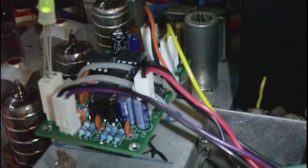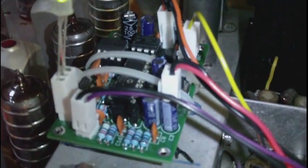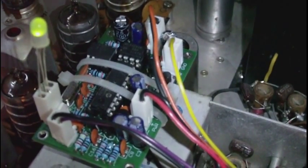I would call this a success. This little circuit cost about 40 bucks and took a couple of hours to build. I'd put it at medium difficulty level — you just have to use a small low-wattage iron since the traces are really small, and some of the parts like the quarter-watt resistors are small too. You just have to be careful to get good soldering and use a magnifying glass. It worked right off the bat — I didn't have to do any resoldering or checking; everything checked out and works as advertised.